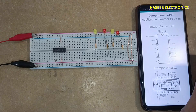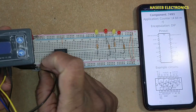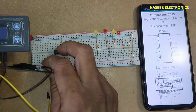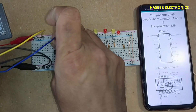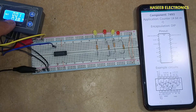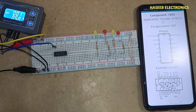Pin 14 is clock A — it will receive clock pulses and count them in hexadecimal format. I am using a PWM generator. The positive and signal lines connect to pin 14 as the signal input. I am providing a 1 hertz clock signal with 50 percent duty cycle.